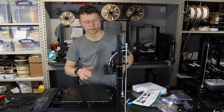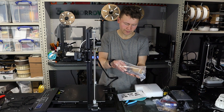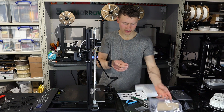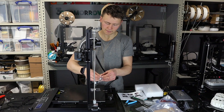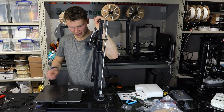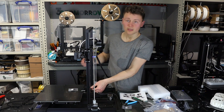We can now install the gantry onto the frame — we just lift it over like this. There are some T-bars already installed onto the base of the frame. In this pack of tools we've got some Allen keys, M5 sliders, some screws, and spare nozzle parts. We're going to need the M5 by 8 sliders and screws. We slide them up the side here — same on the other side — move the bed down out of the way, then put the screw through the T-bar and into the sliding nut.